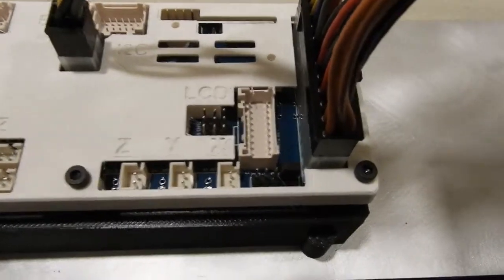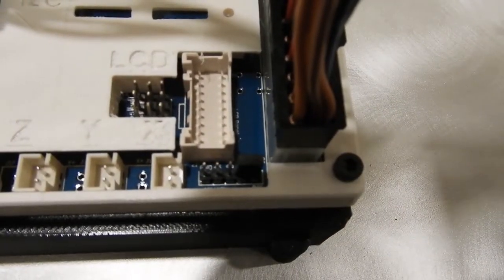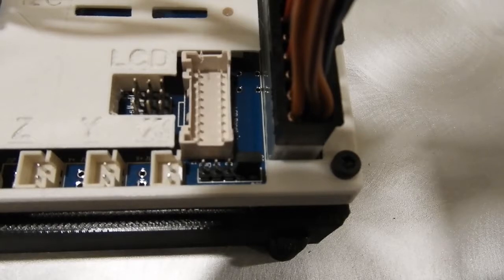On the ReliaBuild3D board, the design added a ground connector on the header pin to enable simplification of the cabling. This board has 5 pins and will require the 2-pin cable for powering the touchscreen. The power enable jumper stays on the ReliaBuild3D mainboard.